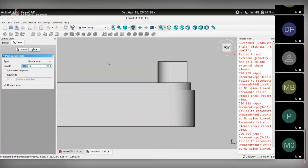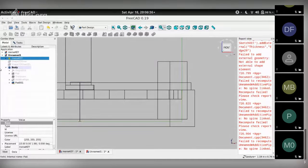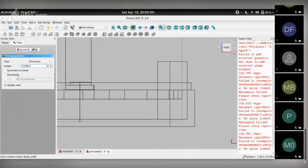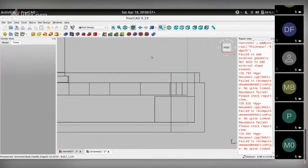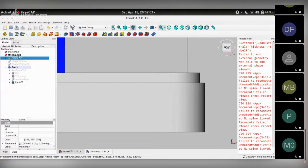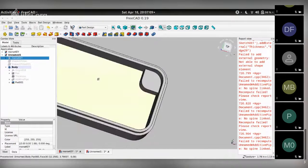So let me look at the front view in wireframe, unhide the PCB so I know the height of the PCB, and then give this number over here. Let's see, 0.12 and 1/3 of an inch, leaving some clearance for 3D printing expansion. So that's that. We get out of wireframe again, go to flat lines, hide the Morse key PCB, and that's your support structure for the PCB over here.